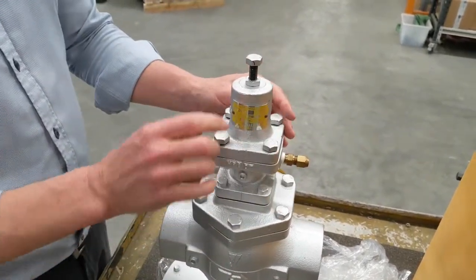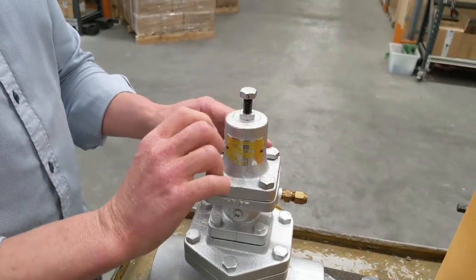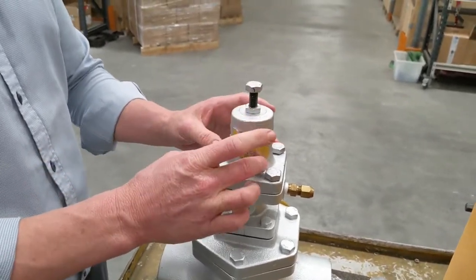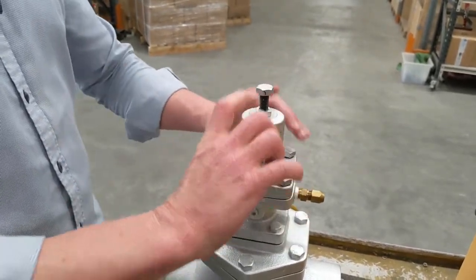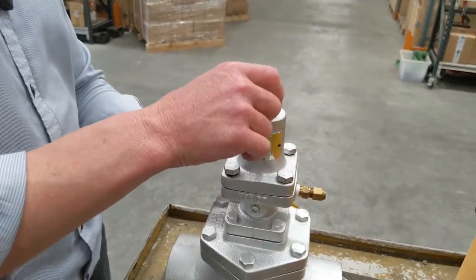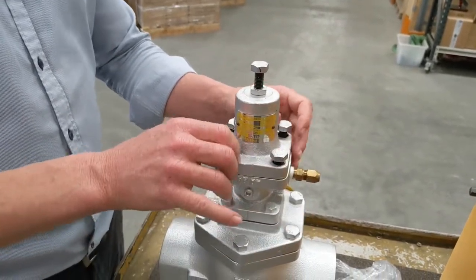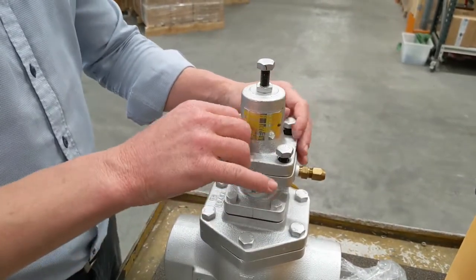One thing to note is this bolt on the top — it sets the pressure range that you're reducing to. It does that by compressing on the spring which is on top of the diaphragm. So if this is wound in when you back these bolts off, there's going to be tension in the unit as it wants to push and advance the spring. It's best to make sure this is backed off first. That way when you take it out there's not going to be any tension. If you're not sure, do the bolts in a diagonal pattern — that way it will release the tension in the spring as you take the pilot unit off.